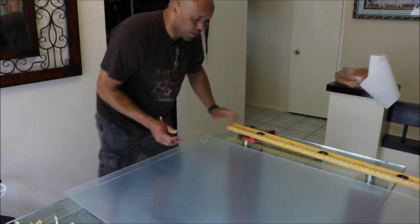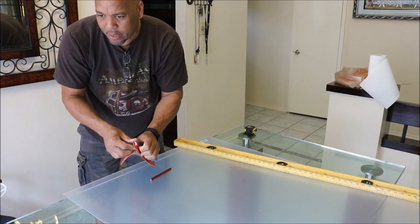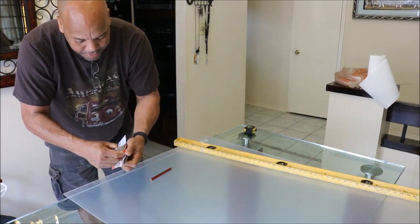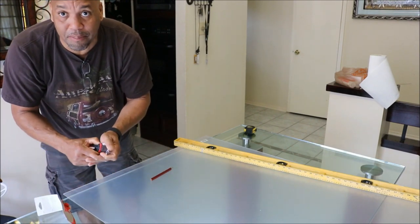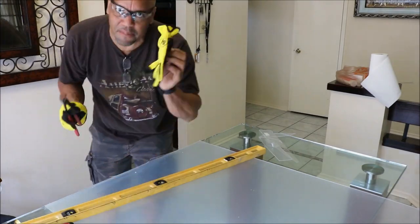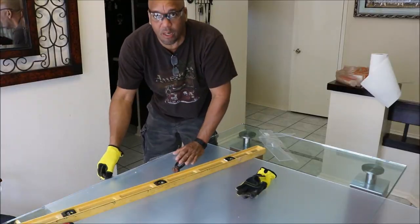The things you're going to need: a nice straight edge, and a scoring knife — when you buy plexiglass at Home Depot they sell the knife right there. You can also use a sharp blade. All you really need to do is score along your line before you snap it. Measure twice, cut once — that's what my father told me. And use safety gloves because the plexiglass edge will cut you.